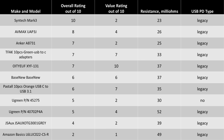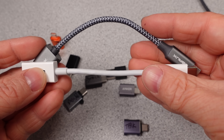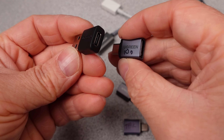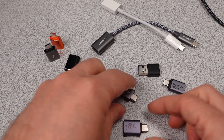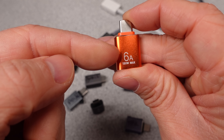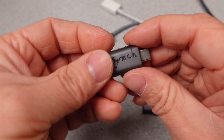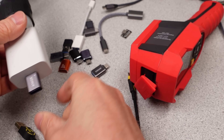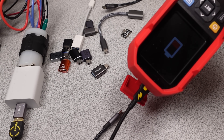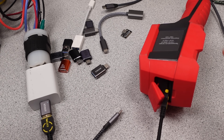So what are some of the issues with these devices? Well, if you ask for 3 amps from a USB-C port, it's probably going to try and deliver 3 amps regardless of whether your device is set up correctly or the cable can handle it. Thankfully, this is still a pretty low current value, so barring using those really cheap steel USB cables that catch on fire, it should be okay in most situations. But know that you aren't getting the USB smart communication — this is setting the limit at 3 amps on that port, whether your device can or should use that is not considered. Things like battery chargers that aren't quite made right could have problems with this. The data side could also run into issues — you are introducing potentially unknown quality signal traces in between the USB-C and shielded cables, so data rates through an adapter probably won't ever be as good as a proper cable directly connected device to device. The connectors on the cheaper side will probably break off or stop working with any pressure on the connector.